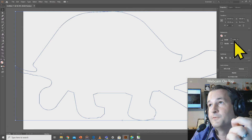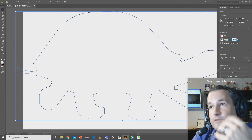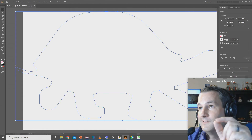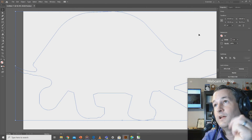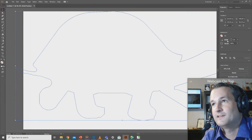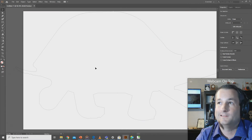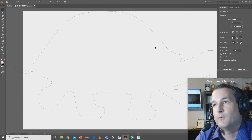For our particular laser, we change the stroke. The default for the DXF looks like it's 0.79. To make it easy on ours, I go to 0.00001 as the stroke weight. It'll change to zero in some versions of Illustrator because it rounds, but I assure you it's still the correct size — it's not actually zero. If it were actually zero, when you clicked off it you wouldn't see it at all.